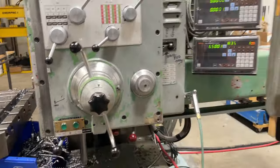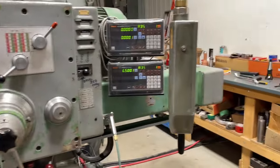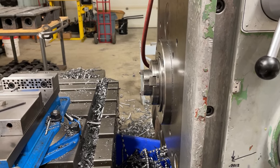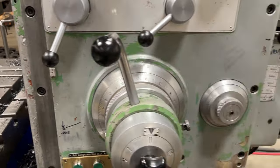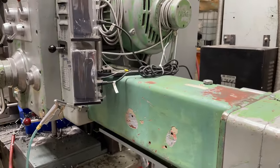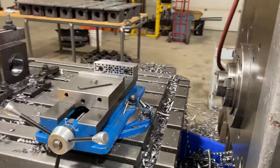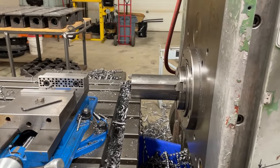In this machine, you would need a drawbar, I don't know, 5 feet long probably in order to do that. And if the shoulder is at the back end, you'd get a lot of stretch in that drawbar and a lot of twist while you're trying to tighten it. So the actual clamping portion of it is very short. It's just behind the tool. And then that part is attached to a tube, and that tube fits over another tube, and it creates a telescoping drive shaft. The drawbar is actually like a telescoping drive shaft, and there's keys in it that transfer the torque from one to the other. And the reason for that is because this spindle moves. So in order for that spindle to come out, the drawbar has to get longer.